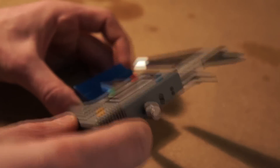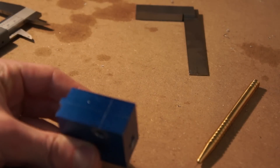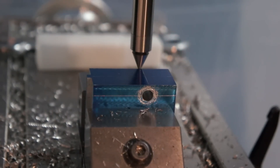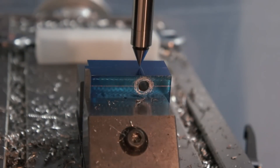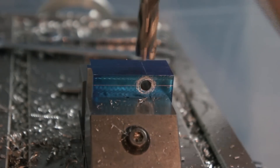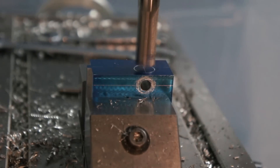Here I'm just laying out the scribe marks for where I'll be putting the cutout for the knurling wheel. I didn't make these blocks to any specific size, so I scribed them from both sides just to make sure my alignment was dead on center. Here I'm picking up that center scribe mark — what makes it look off-center is that the tip of the centering tool is slightly bent, but this isn't ultra-critical; within five thou is more than enough.